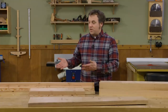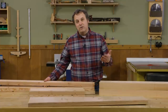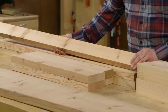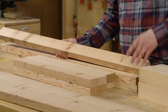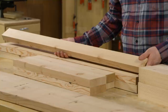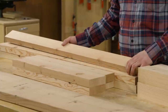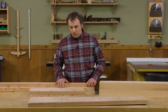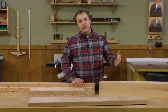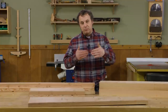What we're going to do — and I've already started this process — is break it down into project pieces. When you pick through boards at the home center or lumber yard, you'll find that one face can have large, unsightly knots while the opposite face has really nice straight grain. By orienting your pieces, you can still get the look of higher-end Douglas fir without paying that higher price. So I'm going to take this board over to our jointer-planer combo machine, straighten the edges, flatten the faces, plane it to a consistent thickness, and then go to the table saw to start breaking it down into pieces.